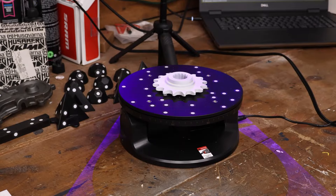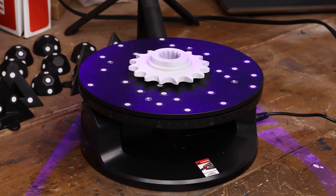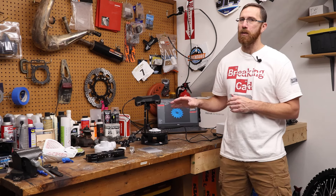Full field mode doesn't work great on shiny black objects, but works wonderfully with scan-sprayed objects and works great on many other objects. I was able to capture a machined aluminum part with a clear anodized finish just fine. Some shinier things were harder to scan. I'd certainly recommend having scan spray around because it makes a big difference. Using the turntable is basically a one-click operation — set it up, click, and it does it all for you. In single shot mode, flip it over and align those two scans.